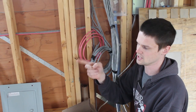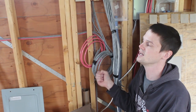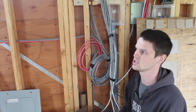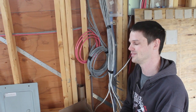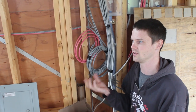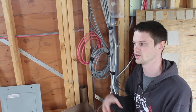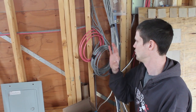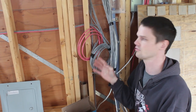There's also an extra cable down to the kitchen sink for the same foot-switchable thing, and we'll have extra conductors in the wiring for maybe something down the road. There's one for up in the kitchen cabinetry where there'll be a general dehumidifier for the whole space, which being 12 volts could run off-grid potentially. There's another cable that goes up to the loft for general purpose — possible applications would be if we wanted a heated blanket in the winter, or if it's too hot in the summer we could hook up a tiny air conditioner or a fan, and that could all be powered off the battery. So we've got a bunch of extra wiring trying to think ahead to all sorts of different possibilities.